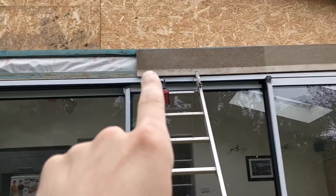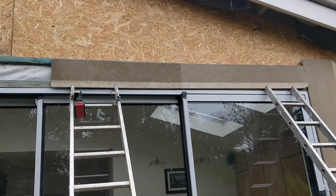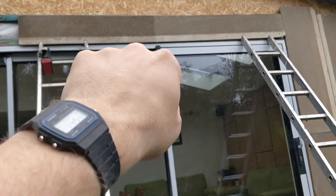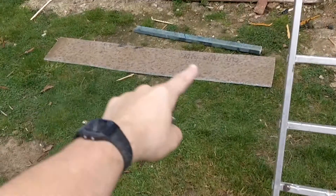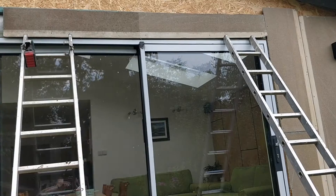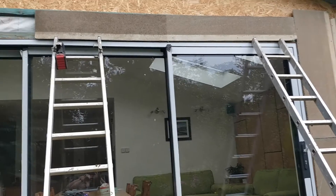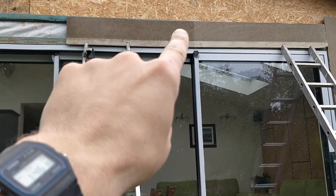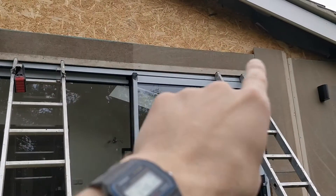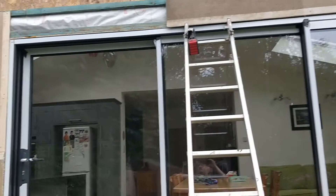It's just started raining so I'm going to keep this fairly quick. This section I haven't secured up yet — I just had to go and get my drill bit to zip that in. There must have been something laying on top of it so that bit's wetter than the rest because it is raining. I've got this section to fill in this gap and I'm using the old two-ladder trick to support it, because it's quite flexible stuff and I don't want it wobbling and snapping. I'll screw in top and bottom the whole way along and then switch ladders.